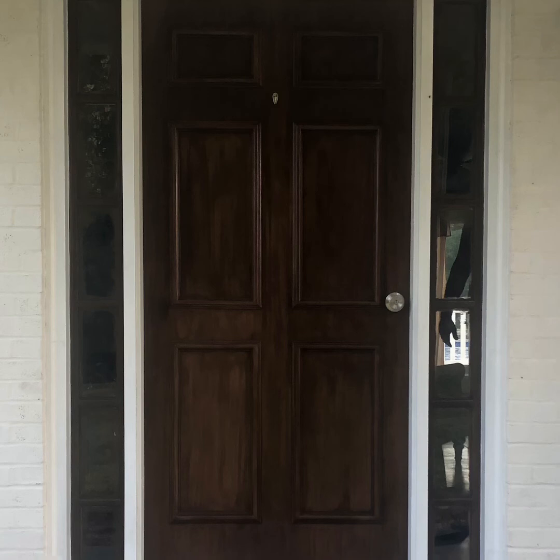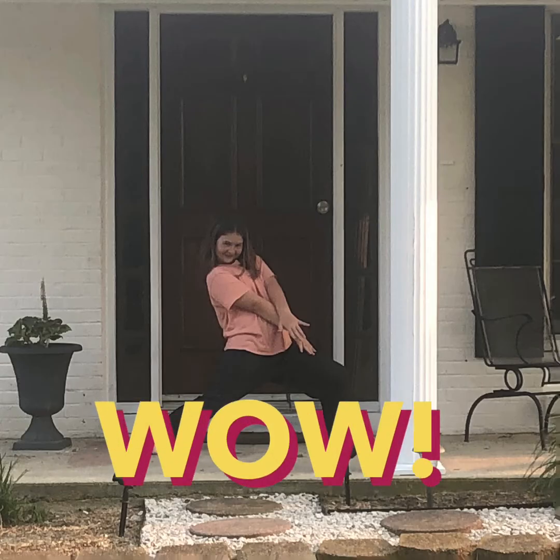And then after I had completed the stain, I did some more research and found that I needed to apply a protective coat, especially since it's an exterior door. It's going to be exposed to a lot of weather and hot, cold climates. So I got an exterior polyurethane to apply, which was only about $10 or $11 also. But this took me about 2 weekends to complete.